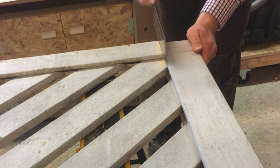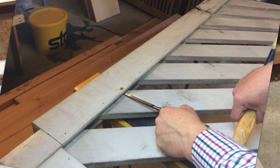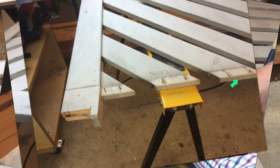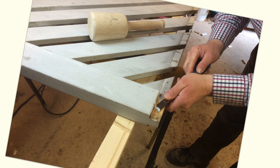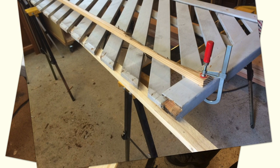After that it was more sawing just to weaken that frame so that I could take it apart in pieces. While I was doing that I also took an old chisel and cut off those little nails by hammering the chisel in between the frame and the board, so that the whole frame — the middle part of it — got loose and I could remove it. I then made sure that all the remaining wood pieces and glue remnants got cut off very cleanly with the chisel so that the remaining part of the wood was clean enough to glue a new piece back on.